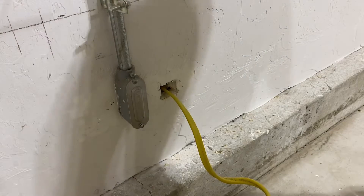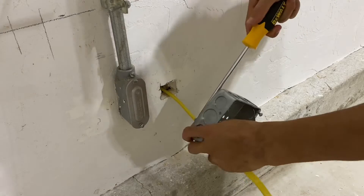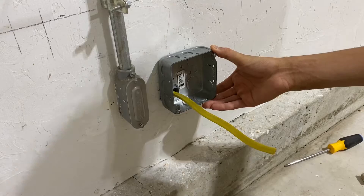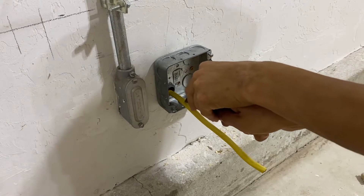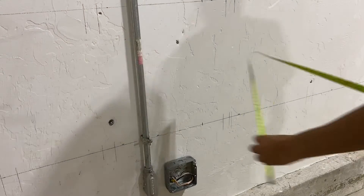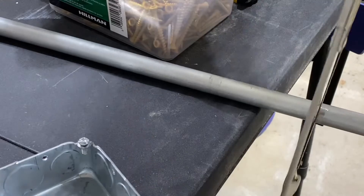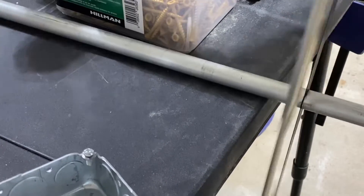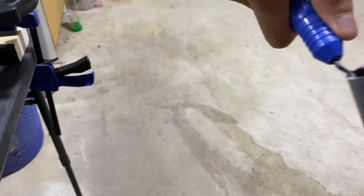Back in the garage I'm going to cut this wire. Let's push this back and use a couple of deck screws to cinch this down. My next box is going to be 23 inches above this one, so I'm going to need to cut some conduit. Just cutting this with a normal hacksaw. Then I'm going to use my deburring tool to deburr these rough edges so the wire doesn't get chafed.